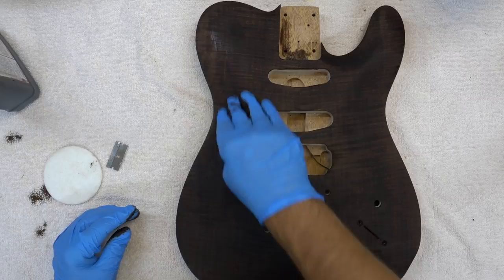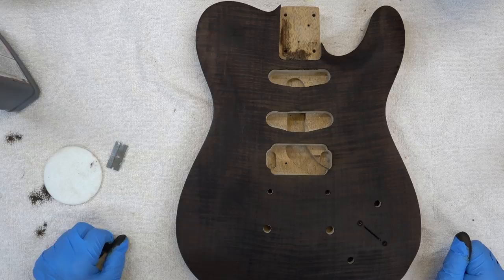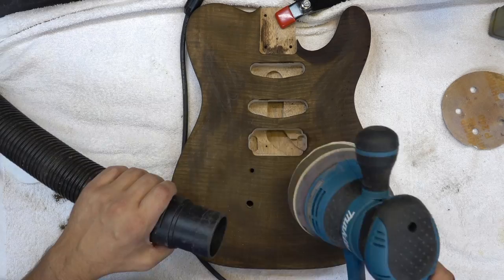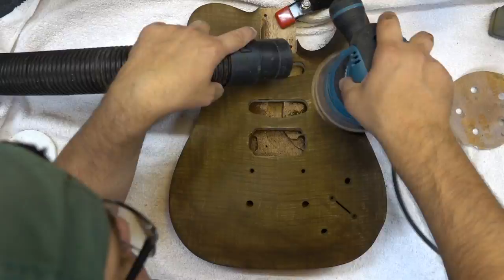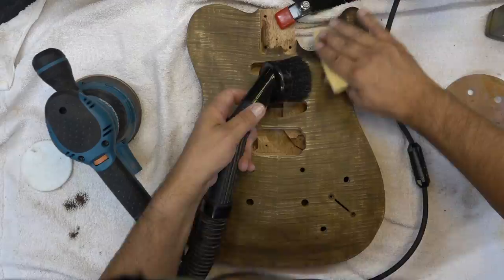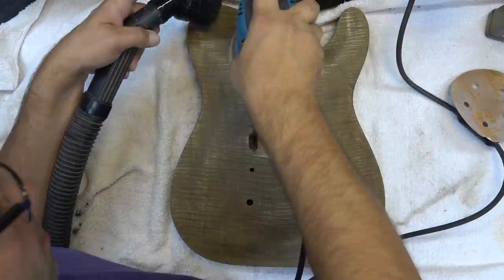We're going to let this sit for 24 hours, then come back with either some steel wool or thousand grit — something really high — and take some of this off, and then we'll apply the yellow. I start with a hand sander but that really wasn't doing what I wanted it to do, so we're going to sand the corners and the top starting with 600 grit. That wasn't working too well, so I come back with my orbital sander with a foam sanding pad so I don't actually sand out any of the contours. This just really helps get that color off without changing any of the contours — if I had too aggressive a grit you would see spots go white to look like the maple. We'll go back and forth, vacuum it up, and this is looking pretty good, getting ready for the color.